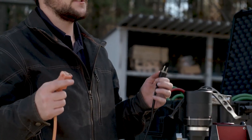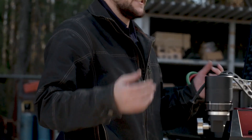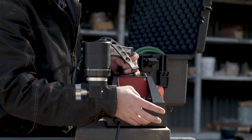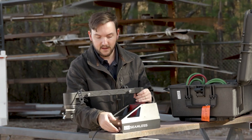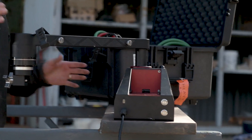You're going to want to go ahead and connect your Mach 1 base machine to a 120-volt outlet, just based off the cord coming out of the back of the machine. What that's going to do is enable you to turn on the electromagnet on the bottom of your base machine. By pressing this button here, my magnet is on; by pressing it again you can pick it up and place it wherever you'd like.